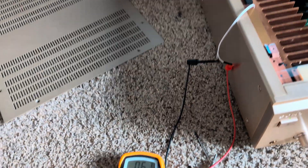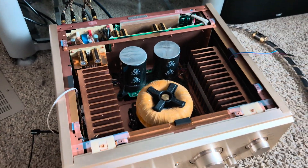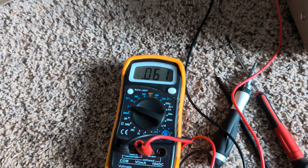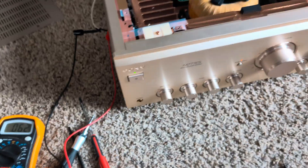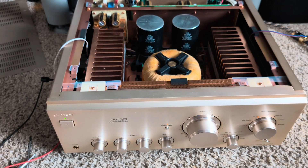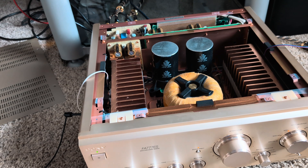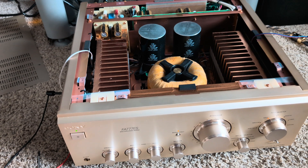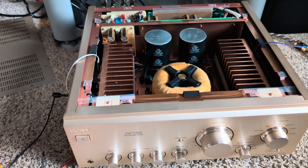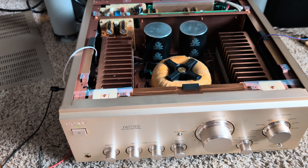After power-on it shows 61 millivolts — we need to get to 70, but we need to give it about 15 minutes to warm up and then set it. It's starting to slowly rise. It would be good to verify and make sure that after all these years it still performs up to spec. Also note: this amplifier is full MOSFET including the input circuitry, so you should NOT connect RCA cables while the amplifier is powered up, because you can easily kill the FET transistors on the inputs.